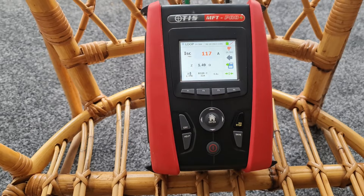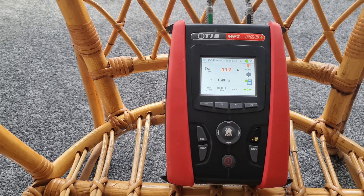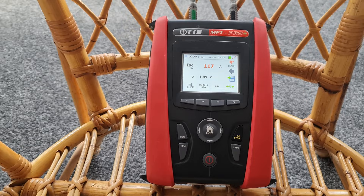Coming to make that live measurement, it's less upset by that corroded CPC terminal and it's possibly picking up a fortuitous path back to earth in other systems that are now connected. When CPCs and lines were outside of the board during dead testing, those paths weren't in circuit. Now they're back in the terminal bars within the consumer unit, other factors come into play.